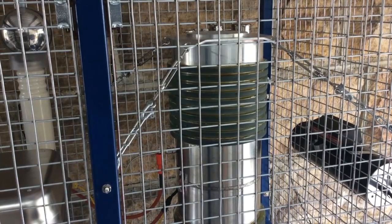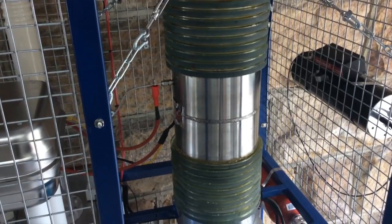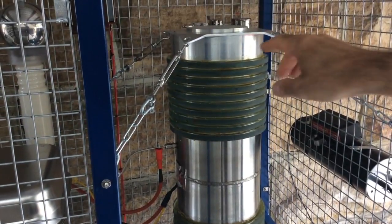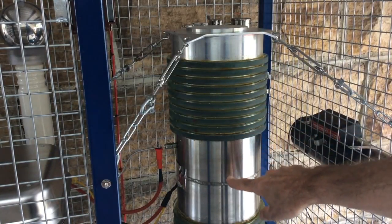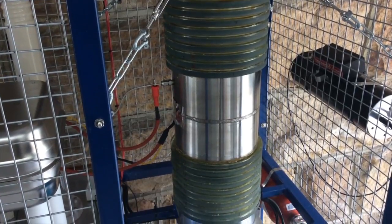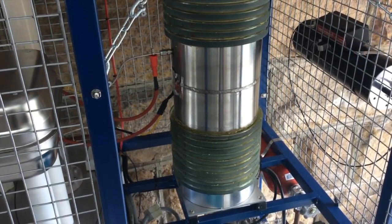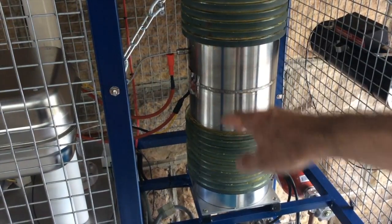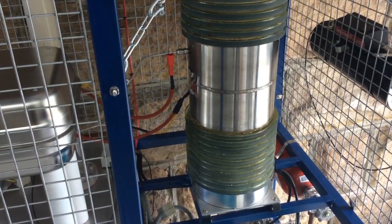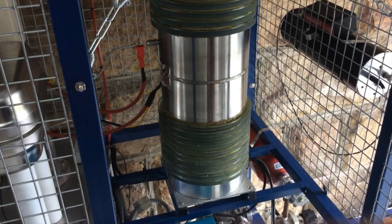Let's take a quick look at the chamber as well. Opening the door here — you can see the vacuum chamber, it's a double-ended accelerator. Stainless steel cathode in the middle, aluminium discs and end pieces on top — this is aluminium here, glass, aluminium discs — and here is the stainless steel cathode in the middle. That's got a six-inch spherical hollow chamber inside with about one-inch holes either side for the ion beam to go through. On the side there you can see the electrical connection which goes to the high-voltage ballast resistor and to the Zener diode that goes to ground. This is where we had the leak down here, which we successfully managed to fix with latex glue.